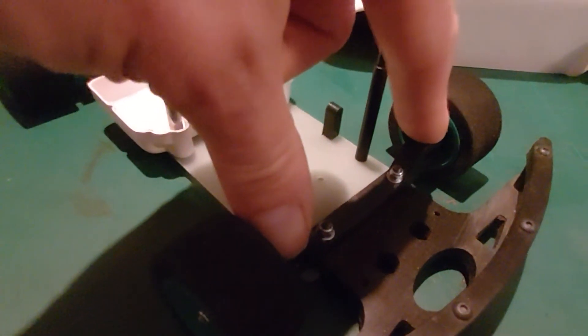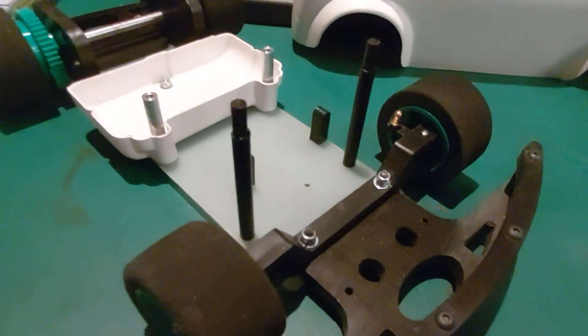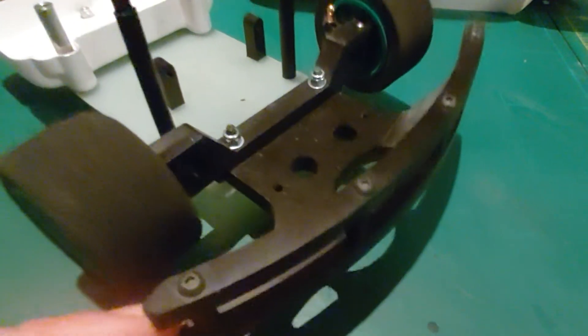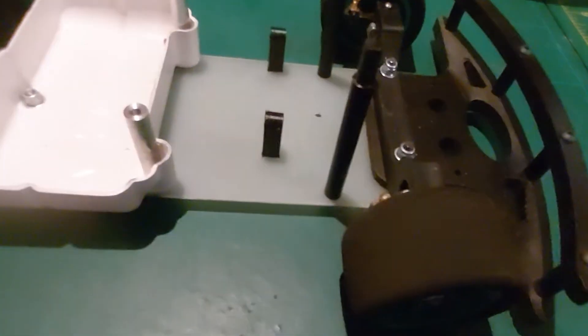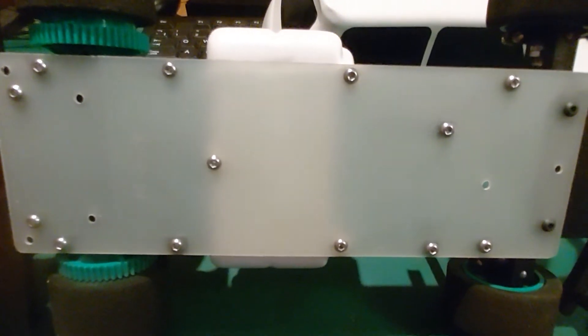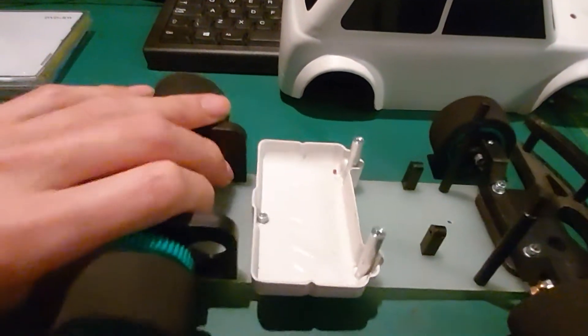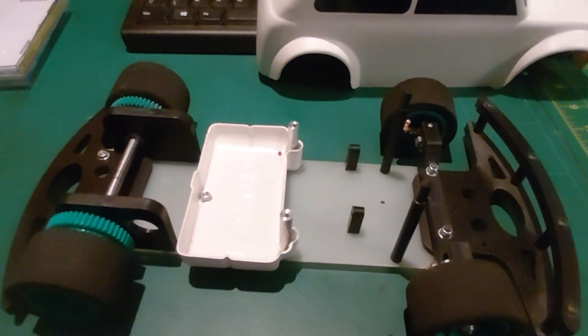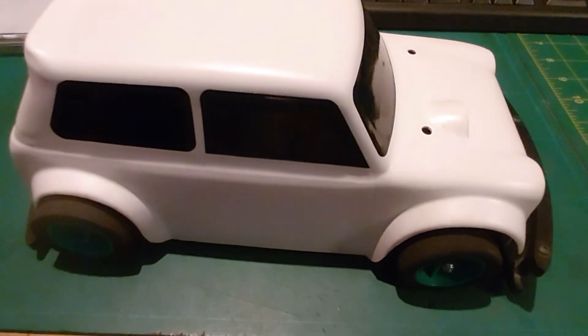You could just have a little circlip on each end — that would be really straightforward. The front bumper is the same as the rear one. On this I've got some acetal rod with three millimetre threads tapped in there and little hex head button screws. That's all the parts — it's really straightforward. The chassis is just glass fibre, but that could be marked out by hand from aluminium sheet. It barely weighs anything. You can source the electronics or use them from an old radio control car from eBay.